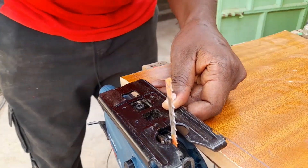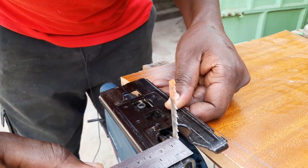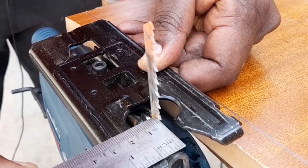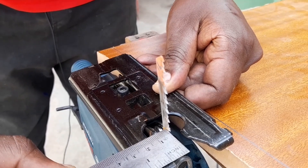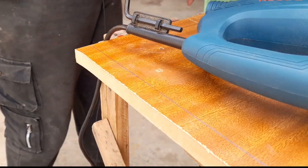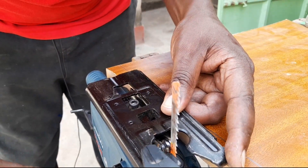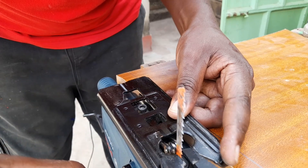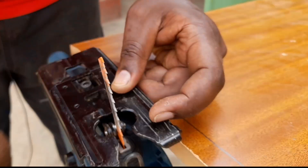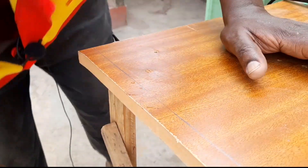To achieve that, you can use a ruler, place it there, and get to know exactly where that gap measures. This is 3.1 centimeters, and alternatively you can also measure using vernier calipers — as you can see, that also measures 3.1. So we're going to go on to the next step.